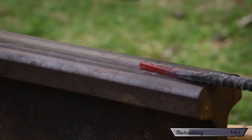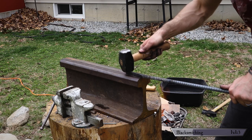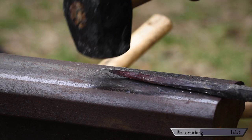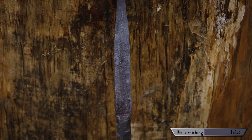I was having a lot of trouble because I did a poor job securing my makeshift anvil. It might have worked if I'd sat it into concrete or something. Luckily I had bought a piece of railroad track from an antique fair. I didn't use it first because the top was rounded, but I was wrong — that thing is awesome. On blacksmithing forums they say you've got to grind the top flat, but they also say the mass under the anvil is really what makes the difference, and it's absolutely true. The feedback I got while hammering was fantastic — I felt way more in control. So get yourself something pretty heavy if not a proper anvil. The closer I got to my final shape, the lighter I hit — it was mostly straightening out the peaks and valleys to get a uniformly thick, evenly pointed piece.